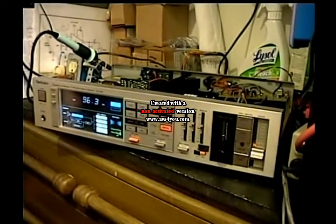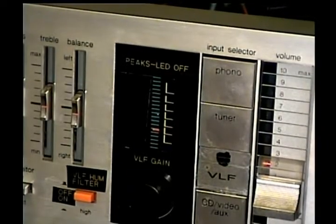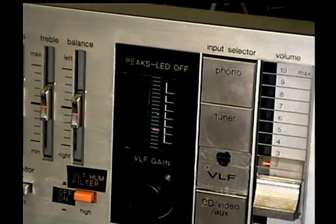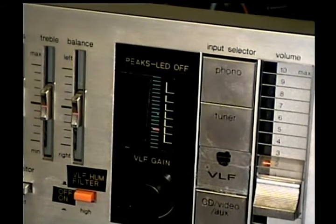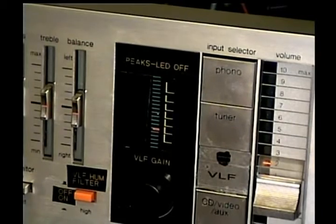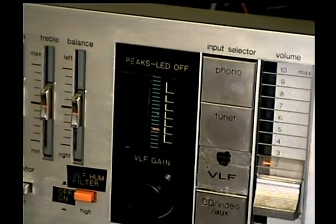This receiver now has built-in VLF. This unit had been in mothballs for about nine years or so. My son and I were playing it one night and he put on a rap or hip hop piece, turned the volume up and the bass up, and when he hit the loudness switch the left channel output amplifier blew. I had a crossover network with a little too much coupling between left and right channels on the subwoofer part of the circuit, and apparently the signal caused the amp to overload and blow. But this SA350 has a unique feature.